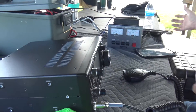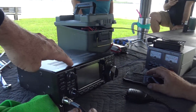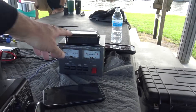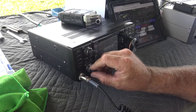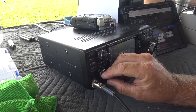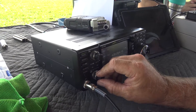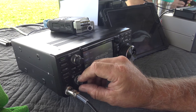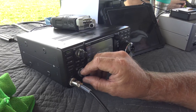So let me show you guys the contacts here, because John is the satellite master. And you're going to see on the screen here in the video that this thing is adjusting for Doppler shift when we show you the passes that he made. That controller — people ask why is that changing frequency? That's this. And that's going to adjust based on the data from the pass. Kilo Charlie 7, Mike Golf. Please copy Echo Lima 9-7. Yes, I do. Very good. Delta Mike 4 too. Hey, I didn't get your complete call sign, though. Could you say it again? Sure. Kilo Mike 4, Mike Charlie Kilo. KM4MCK. It's a deep fade. Try it again. You came back up. Kilo Mike 4, Mike Charlie Kilo. KM4MCK. Okay, we got it that time.